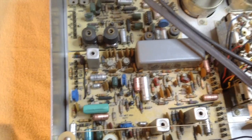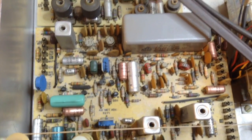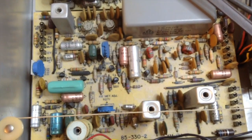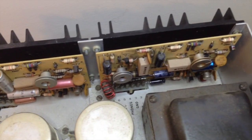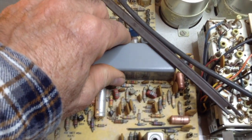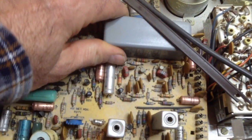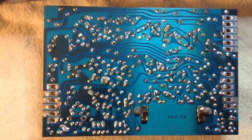Here's an inside look at the chassis. The first thing I noticed is the heavy 0.063-inch aluminum construction — you don't see that anymore on the plastic products we have today. The unit was constructed with separate circuit boards for each function: this is the AM-FM-IF board, behind it is the multiplex board, there are two identical power output circuit boards, a power transformer, and the AM-RF board on top of the tuner. Almost all the boards snap out easily, which was to make assembly easier and will make it very easy to replace components.